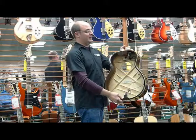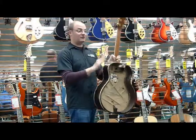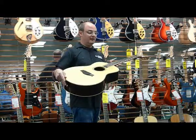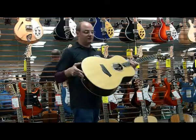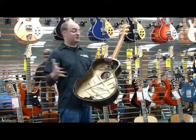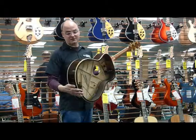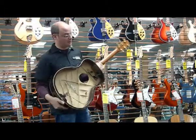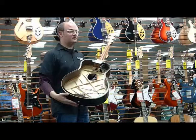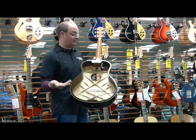It takes about four twenty-second passes of the light, which goes around, and it comes out dry to the touch, ready to be buffed. So now we have a body assembly and finish assembly that matches our neck assembly, so these guitars can move right along throughout the factory and be built and put together at the same time — no more waiting for guitars to dry. A lot of the innovations in the guitars are things that were kind of necessary when you ramp up production. You need to solve problems, and a lot of these innovations that Bob has come up with are the result of problem solving.